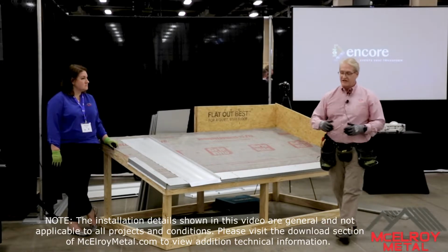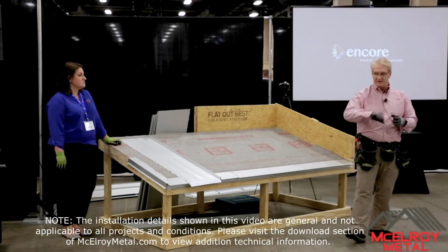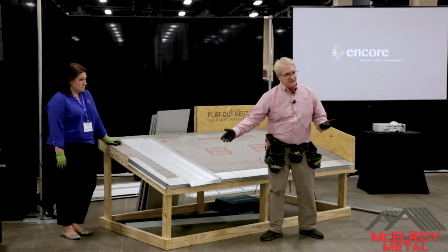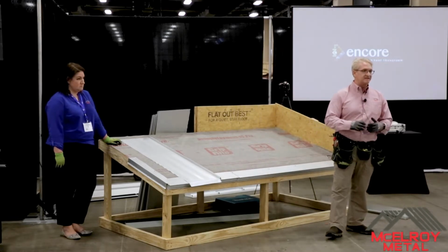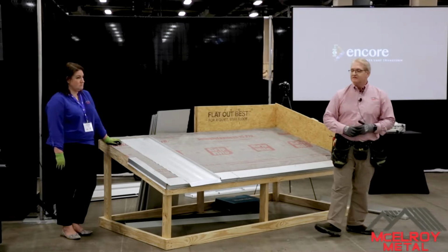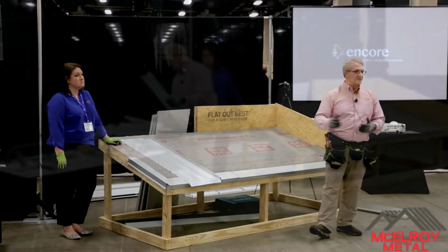That's what looks good. The roofs that we show out here, we like to show them as a hemmed panel. So you literally hem the panel and hook onto a drip edge as a starter. Others out there, and even in our panel, you could screw it in the face. We don't do that. We like to say that standing seam is a little bit more expensive than pole barn steel. So if it's going to be that way, then it takes a little bit more effort.